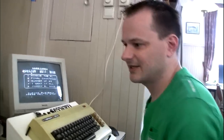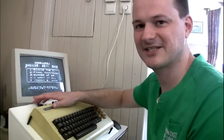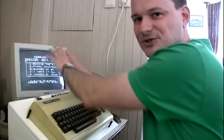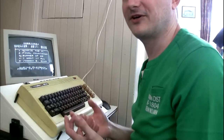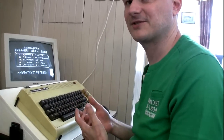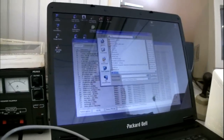How many samples can you have in your Cassiopei? 8 megabytes, because the Cassiopei has a flash memory of 8 megabytes. So your samples can total 8 megabytes, minus a small portion for the program that controls it. The sample is a wave, yes. All you need to do is make a mono wave file, 8 kilohertz, 8 bits, and then you can edit just like using the add file function. You go to the add file function.